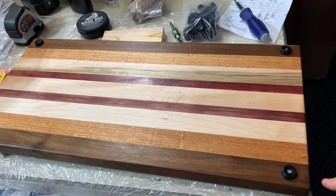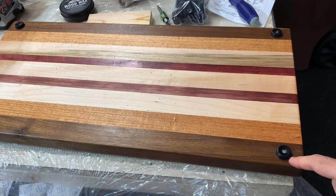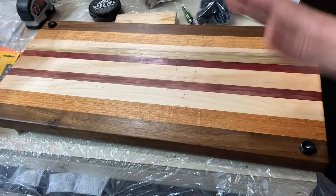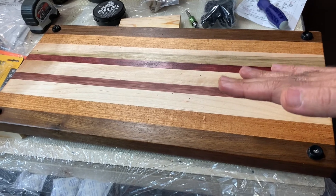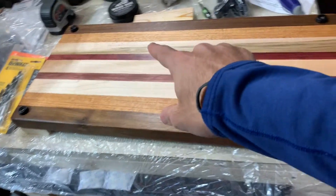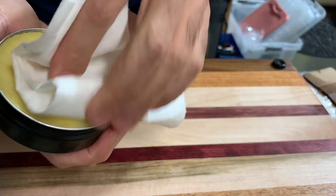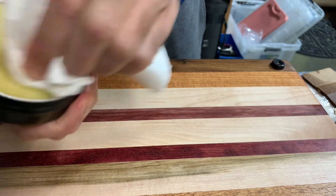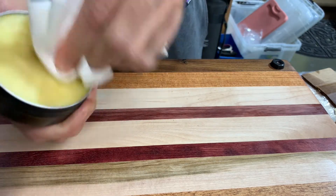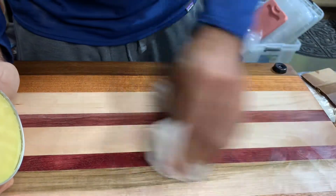Got the feet put in. A couple of notes: don't over-tighten — just get them pretty snug. A stainless steel screw into wood — the stainless steel screw will win. Also, if you have issues with the board not being flat on one side, you can add some stainless steel washers to any of the sides to level it out. For the Walrus Oil wood wax — links in the description — just get some on a rag and apply it. This is a mix of beeswax and mineral oil. Get it on, let it dry, and buff it.